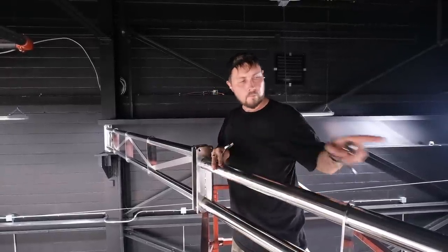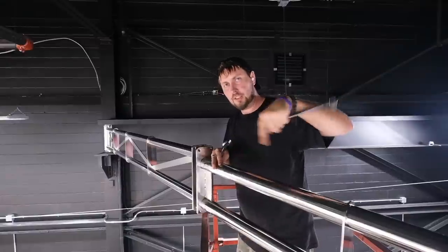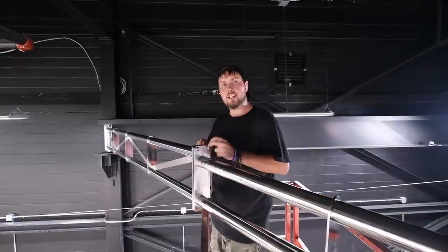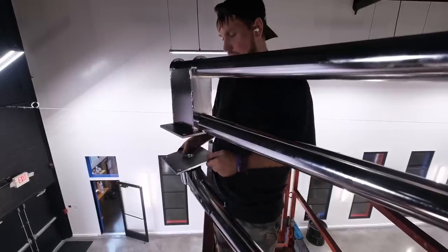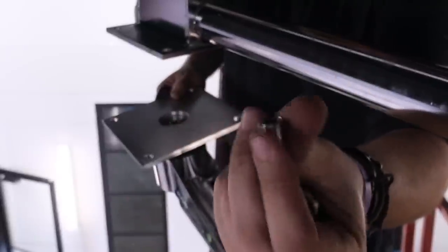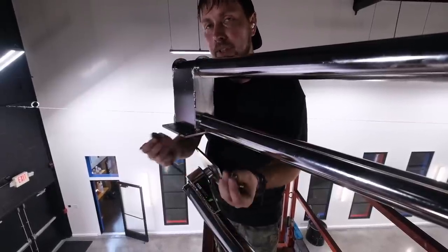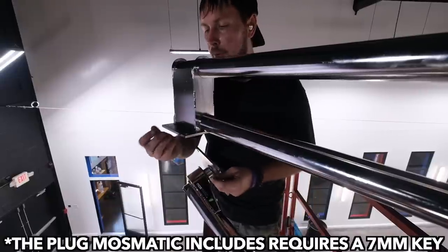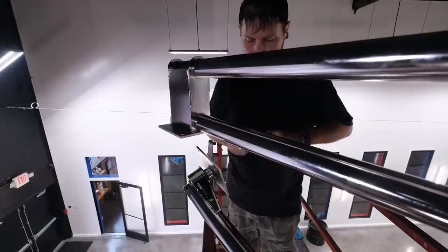One thing I'll show you after this is on the other side there's sort of a 90-degree bend. It's got to aim straight down and then back into the ceiling boom portion of this whole thing, so I've got to make sure I angle that right off the bat. I picked the hottest day of the year to do all this. So I've got the ceiling boom portion and I'm just going to lift it right up to where it goes. There's a port right here that you're going to want to plug — it comes with these adapters. This comes in the side and it comes with this plug that you put right here. However, I have every conceivable hex key known to American men, metric and SAE, and I can't find one that fits this. So forget that — we're going to use a normal quarter-inch hex key. But you've got to plug this hole, or else when you go to fire it up, the water will spray out between these two plates. So that's important.